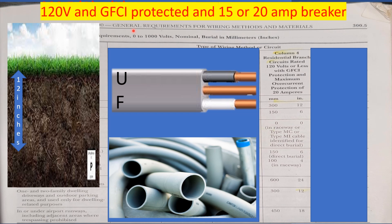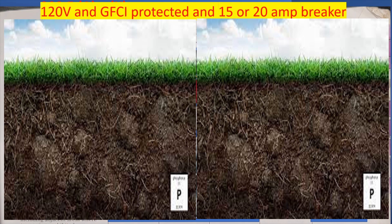If you are dealing with a GFCI-protected circuit that is 15 or 20 amps in pretty much every residential setting, you're only going to be required to dig it 12 inches deep. Think about how much time that will save you in energy and effort. That's if you're using UF cable or a conduit like PVC or rigid conduit. With rigid conduit you could go even less. This is dealing with residential branch circuits — in a raceway or conduit, a 15 or 20 amp GFCI-protected branch circuit only requires 12 inches deep. There are a couple of rules we need to watch out for, so make sure you stick around.